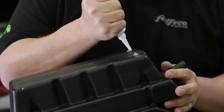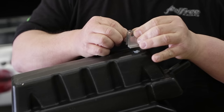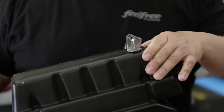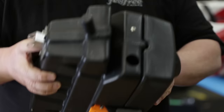You want to make sure that you don't get any water in here after we put this transducer on and we get it to the water. We're going to run these in. I always drill the holes just a shade smaller than the bolt so I can run the bolt through there — that way I know I've got a good connection. Now the silicone that we put on the outside, we're going to do the same thing on the inside.